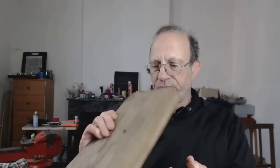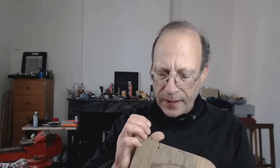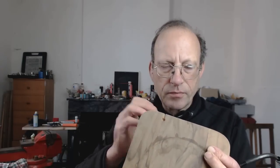just the diameter is about 7.7 millimeters, and the length of the cylinder is 8 millimeters. Okay, so I drilled a hole with a 7.5 milli drill and drilled it down 8 millimeters. And there's going to be the tip point of the drill a little bit deeper, but we can tidy up.